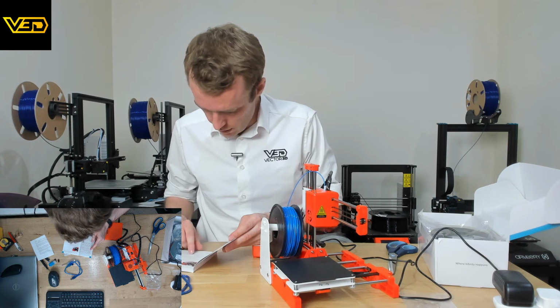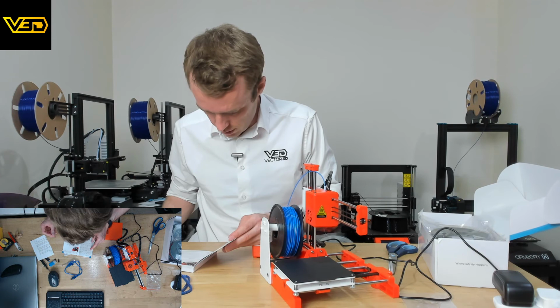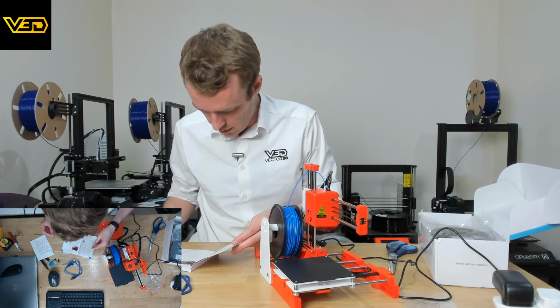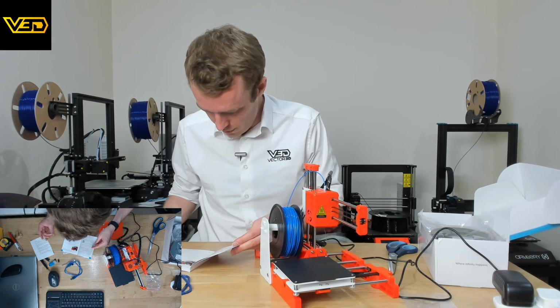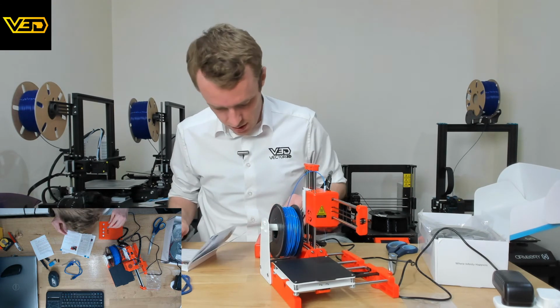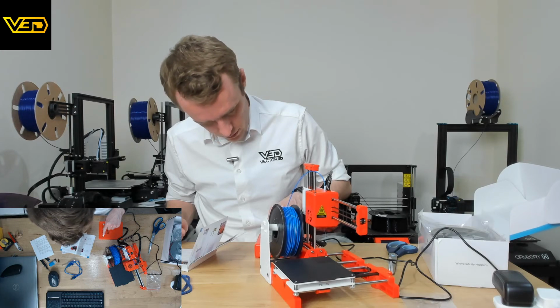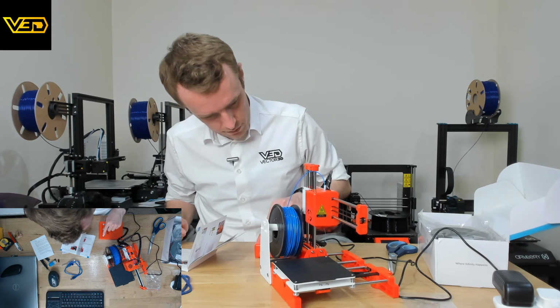Make sure the distance between the nozzle and the printing bed is 3 centimeters at least. If not enough space, press the button plus for 3 seconds, then release hand, Z-axis will go up 1 centimeter. Oh, why couldn't you tell me that before? When the machine stops printing, press plus for 3 seconds, then release. Every time the nozzle will go up 1 centimeter. Users can decide the height. It's not going up. Okay.